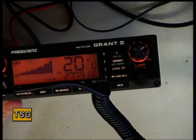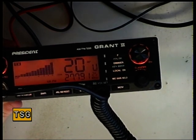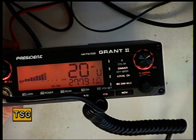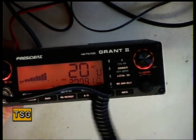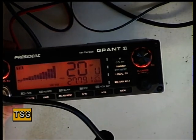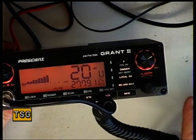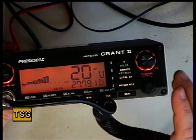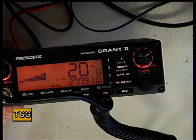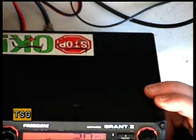It's doing 3.6 watts, and it's about on frequency — that's all right. You can see it will need to be optimised, but that goes without saying. I'll just check the deviation. We should be looking at 2.5 maximum — it's just 2, so it's a tiny bit on the quiet side but well within specification. The power of 3.6 watts is within specification as well, within 20%, which is how it should be.